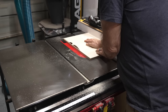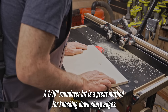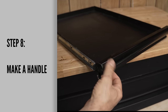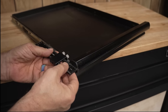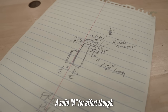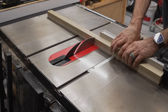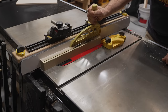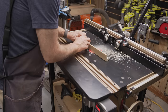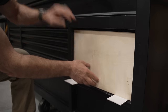I trimmed a quarter inch off the top edge because I had a fancy plan for the drawer handle, then added a sixteenth-inch round-over to the bottom and both sides. I wanted to match the look of the remaining drawers, so I measured the size of these handles and figured out how to replicate them. I started with an inch-and-a-half block of poplar, cut it to 16 inches, ripped one side lengthwise down to an inch, then cut a big notch out of it. I took this over to the router table and put a quarter-inch round-over on the two front edges.